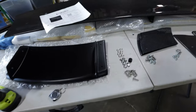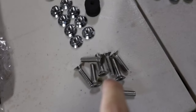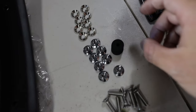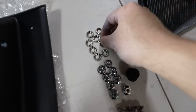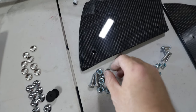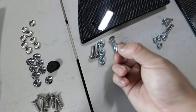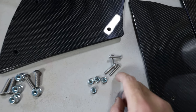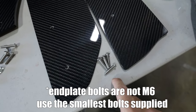So we were sorting out the hardware and trying to figure out which hardware goes where, and the instructions weren't really clear. For the base plate, you're going to use the M8 countersunk bolts with M8 nuts — not the nylon ones, the nylon ones are for the stands. You're also going to have 8 foam washers and countersunk washers that go on top of the base plate at each hole. On the bottom of the stands, use the larger M8 bolts with nylon locking nuts. The top of the stand uses an M6 bolt and nut. Then you're going to use 4 M6 bolts for the end plates.